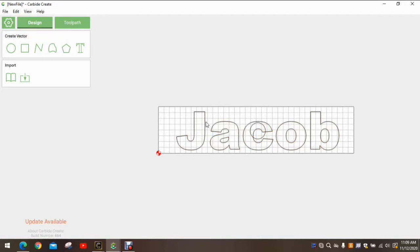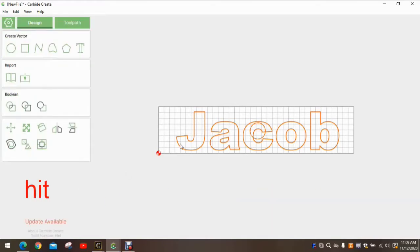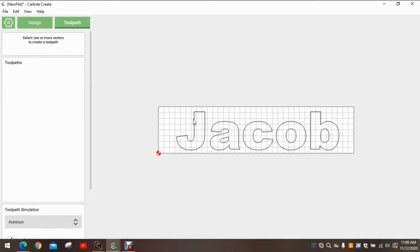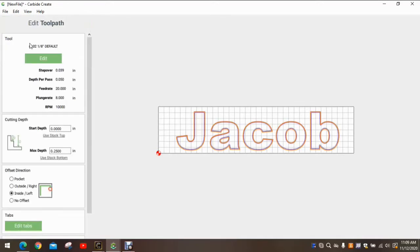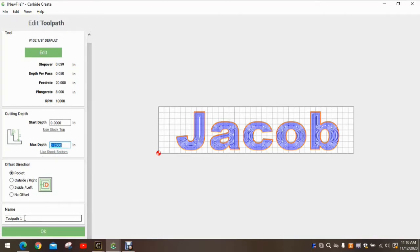Click on the name, then click on the circle while holding shift. Go down and click — right here it says 'Align to Stock.' Click that, hit Done, and everything should be in the center. Delete that circle, you don't need it any longer. Now we'll start doing tool paths. It's a very simple tool path: in one case you cut all the way through to get your parts, in another you just cut a shallow pocket. Go to Contour, check the tool — we use an eighth-inch end mill.